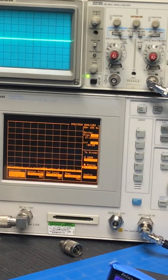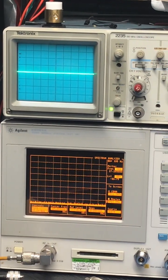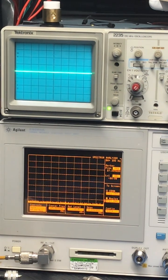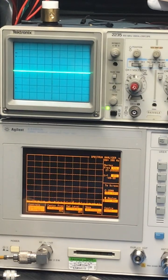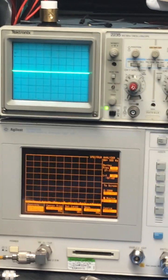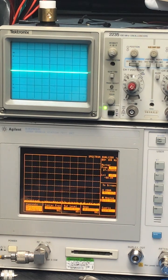Okay, so get right down to the scope. So what was done here on the radio, we did a PPE, not a PEP. We did a PPE, positive peak expansion, asymmetrical modulation. That gives the radio a low dead key with a high swing, and it's nice and clean, very, very clean on the scope. Some guys try to do this modification and they don't do it right, so we'll show you what that looks like.